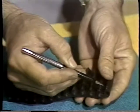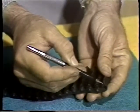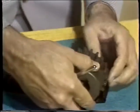Silent chain feeds relatively straight onto a sprocket and, as a consequence, doesn't make much noise. Roller chain must have a roller to match the sprocket, and the pounding which occurs when they make contact creates noise. Silent chain has a straight edge, as you can see, and the contact made is more like two gears meshing.